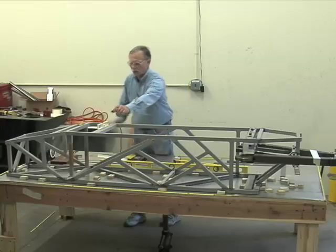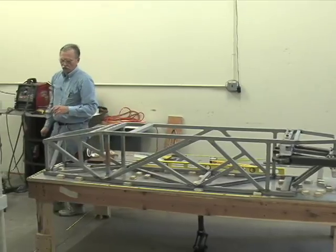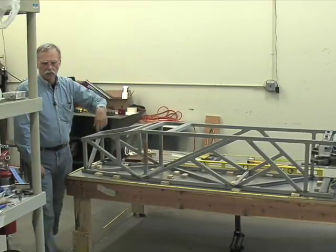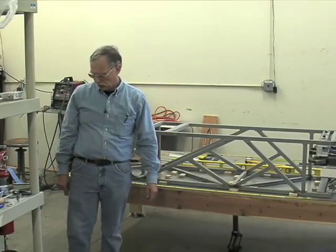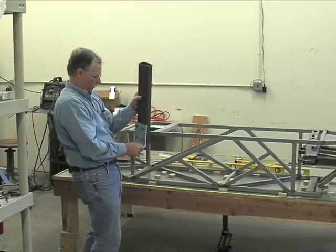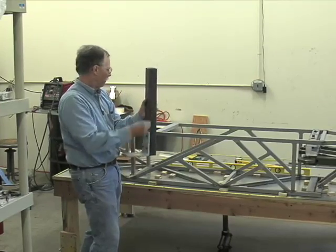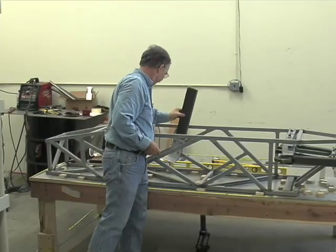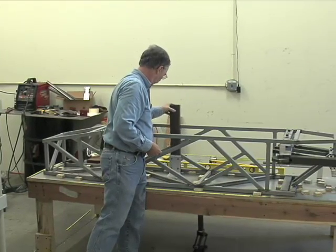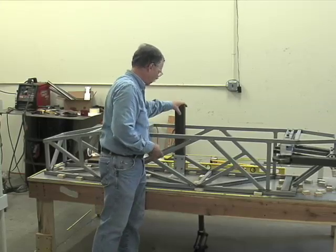So it's obvious that doing the X and Y is simple. Doing the verticals becomes trickier. Now I will show you in a few minutes a second way to find Z. But here, this would be a stanchion. Nothing more than a big piece of angle, big piece of steel, holes in it down here so we can attach it to the table.